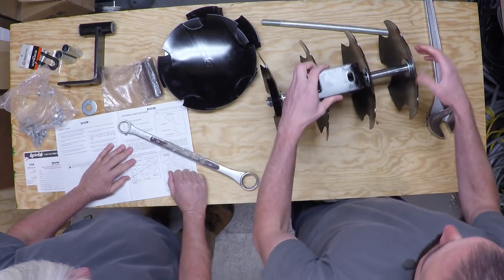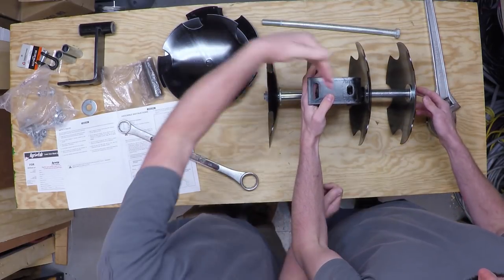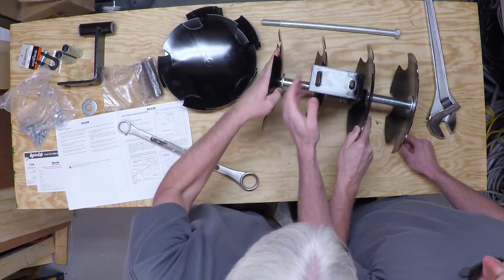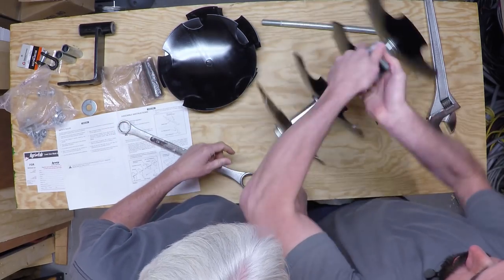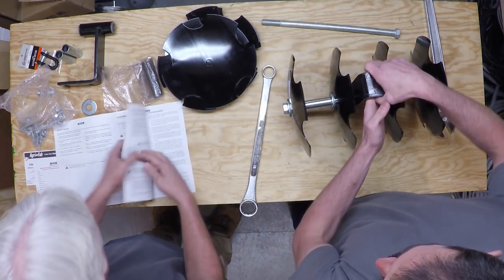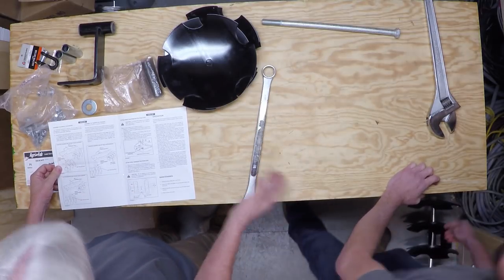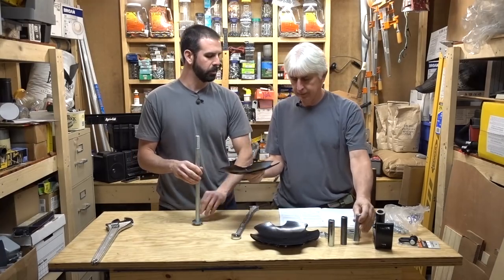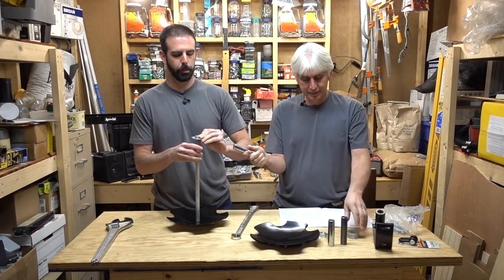If this disc unit was on the right side, you'd hook it up this way and the dirt throws out. Spin it around and the dirt goes the other way. Per pages four and five in the diagram, you might think 'do I want them in or out?' — it can get confusing, but you just build them the same both ways and flip the bracket.